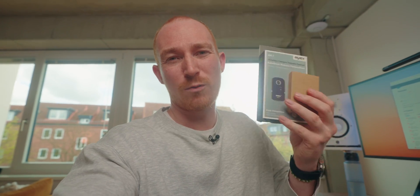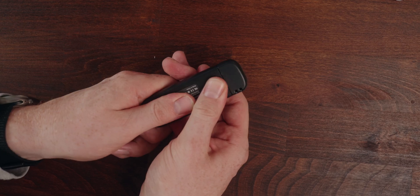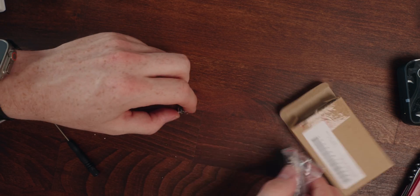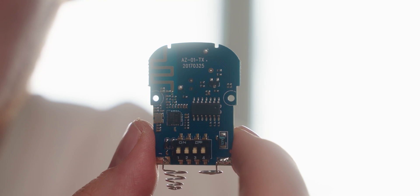The hardware side is definitely what I'm more worried about. Now I've disassembled the remote control and I have my little trigger button here, and I have to solder this into that and I really have no clue. But hopefully with some help from the internet I'm gonna figure it out. I got a multimeter and I'll measure out the remote to know how it switches, do the same with my switch, then desolder the original button and solder the new one on. I'm gonna order some stuff and then I'll be right back.